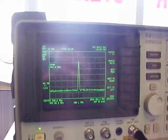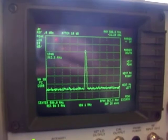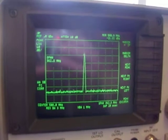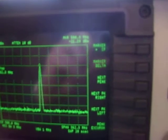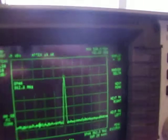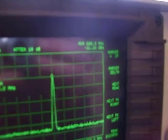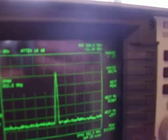And there you'll see the center frequency is set to 500 MHz. At the top right you'll see we've got the marker — that's 500.9 MHz. And it's actually reading minus 21 dBm, which isn't far out to be honest.